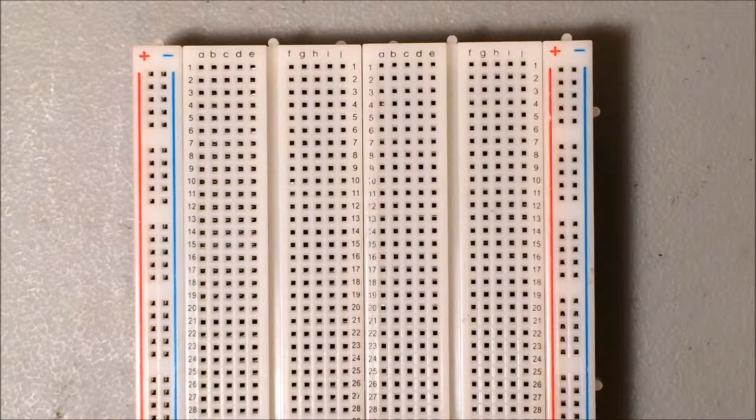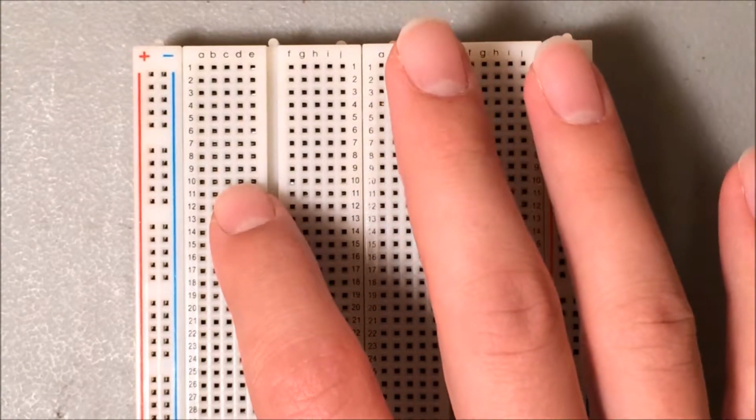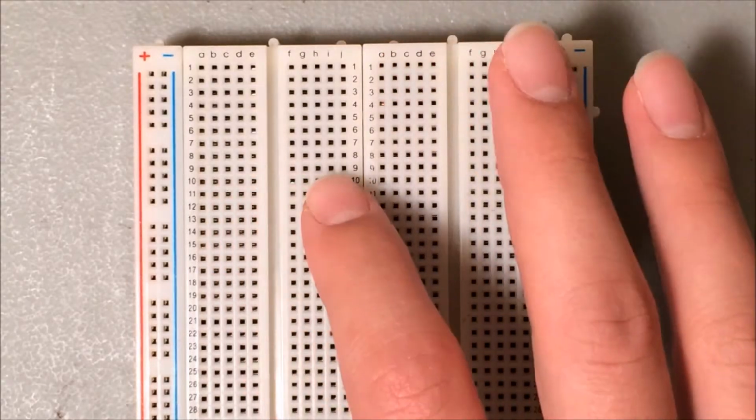By using 7/10 spacing, you can actually mount the LED cube on a breadboard in the event that you don't have the PiMios PCB. The breadboard spacing between the center of each of these sets of 5-dot rows is exactly 7/10.